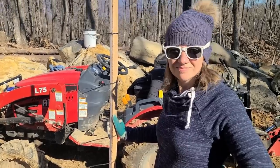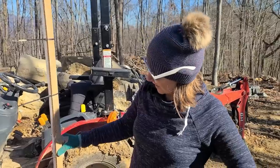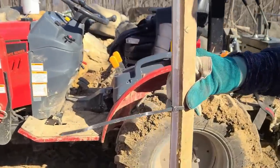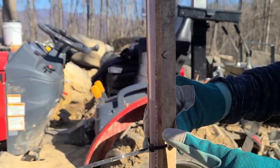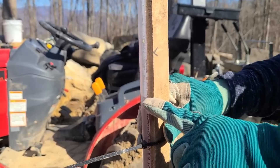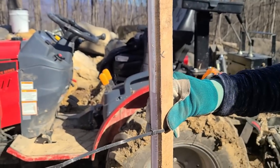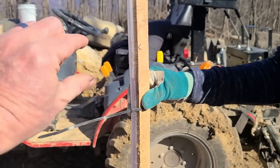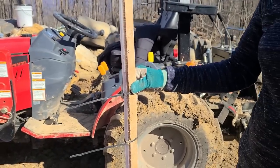Okay, so it's backwards, right, Meg? Can you explain that? The water level is backwards? Yeah, right now this point is below, which means right here is high. See the mark on the stick? We're like 2 inches off. It's opposite of what you think. If the stick's here and that water level is here below your mark, that means you're actually on a high spot. And you need to dig out that much to get it level to our spot over there.